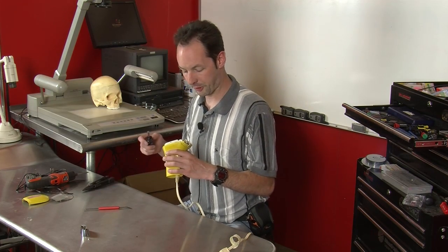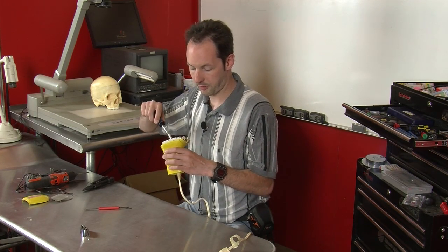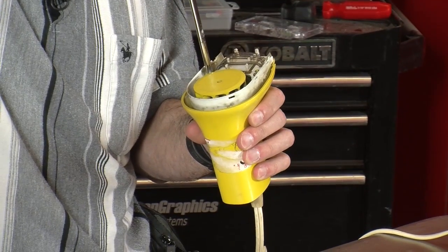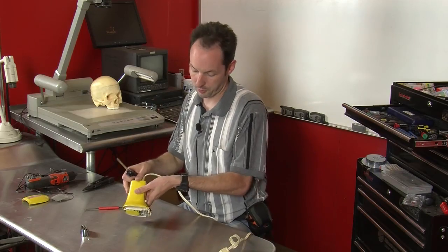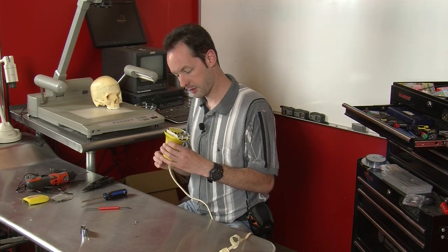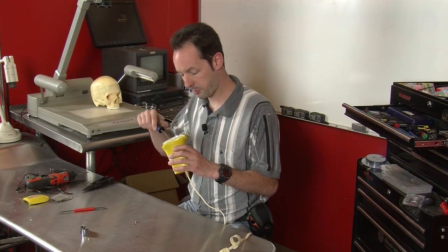The big thing to know with asbestos is as long as you don't eat it or breathe it, it's pretty much not going to hurt you. I mean, it's pretty harmless stuff. Asbestos is dangerous when you disturb it and it becomes fibrous. When you break it up, when you create asbestos dust, basically, and you let all of its little fibers out into the air, then it can mess you up. How do I open that? Asbestos just, up there on the pipe, not going to hurt you. It's fine as long as you don't make it angry.